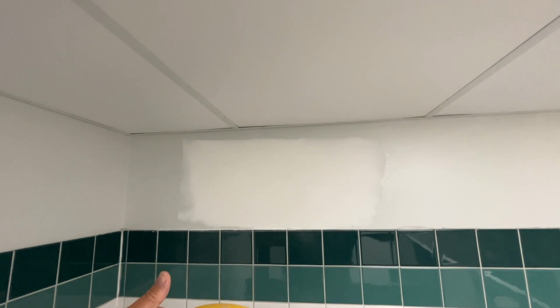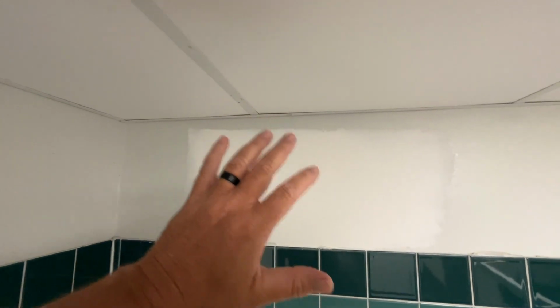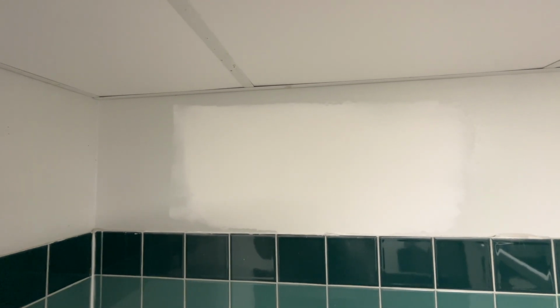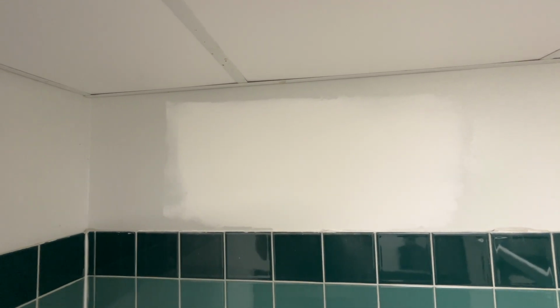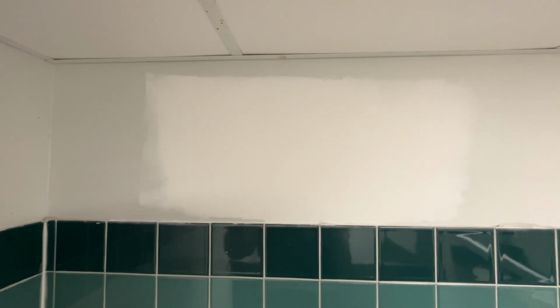I know it's a bathroom, and I know that from down on the floor you may not actually see the imperfections, but while they don't show up much now, as soon as you hit this with paint, any imperfections actually will show up. So I like to take the time to do it properly, and by time I mean this really, it'll take me 2 minutes to mud this little bit, and the time is just the waiting. So by the end of the day, this will be painted. I just gotta go grab a bit of mud right now to touch up these small areas.